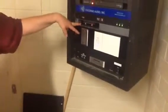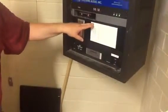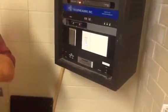This here is a DMX isolated splitter. Essentially, the signal comes from the board, comes into this unit first, and then this unit goes into here, and then this splits the signal out to the two dimmer bars that are out there. There are also two positions on stage where all the LEDs get patched in. If you decide to get creative and start adding instruments or moving instruments around, particularly with the LEDs, you need to remember that DMX cannot be starred. They have to go from in and out to in and out to in and out. They got to be in a line when you plug your DMX together. Otherwise it won't play nice. And hence why we have the splitter in here.